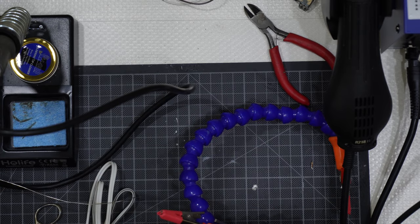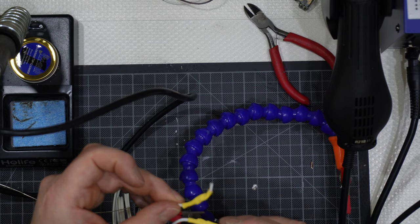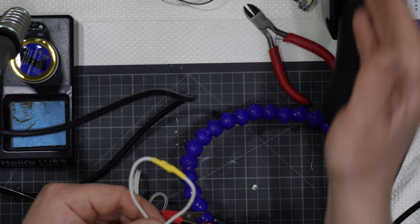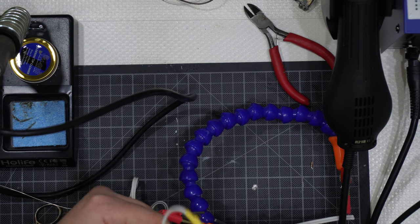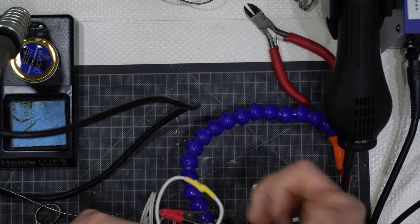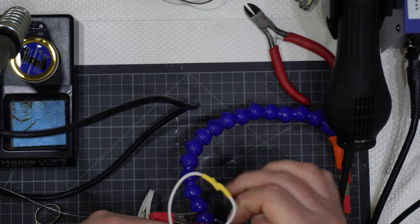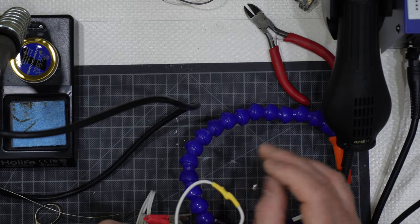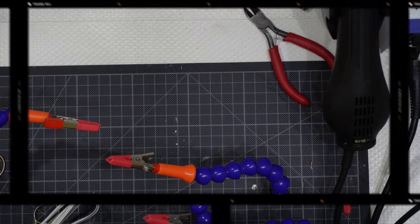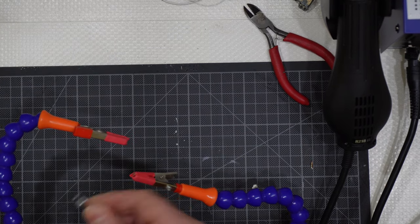Okay. And it is better this way with some hot air than in this case, but the results are very similar. If you don't have this station at your disposal, you can achieve the same result with the soldering iron, obviously, but also with a lighter. It is very dangerous to produce some flame around your work, but even with a cigarette lighter you can achieve the same shrinking, but with a flame, when you burn something, you always have some deposit of combustion around.